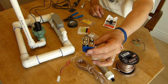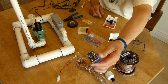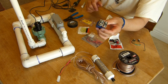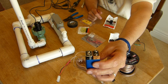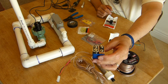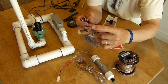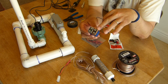Let's start off with the batteries. We use two 9-volt batteries — these are rectangular type. You cannot use just one; one is not strong enough to actuate the sprinkler valve. So you need to have two. I have them back to back opposite, so positive, negative, negative, positive — they're backwards. Then you need to have the connectors, and they need to be connected a certain way so that you actually double the voltage from 9 to 18.